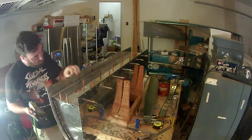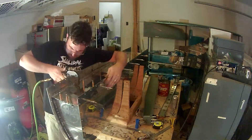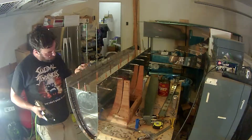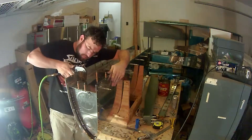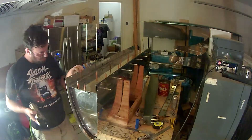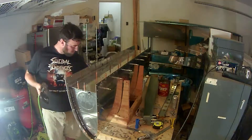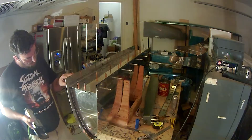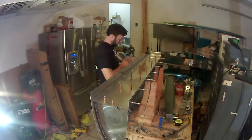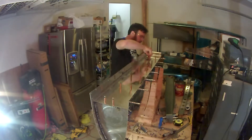Here I've fast-forwarded — now I'm working on the other side and just about done. If you work with the material fast enough, it's not a problem getting the sealant there while it's still workable. So that's what I did: I put everything in and started riveting right away without letting it set too long.